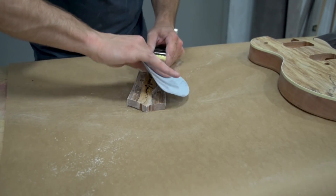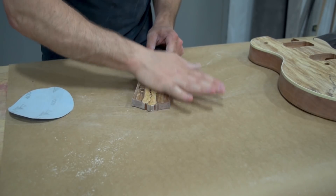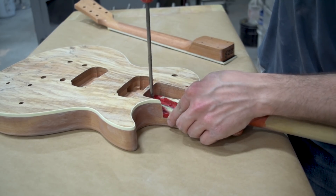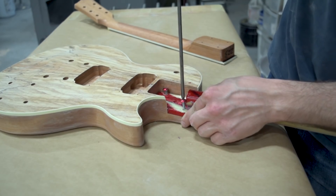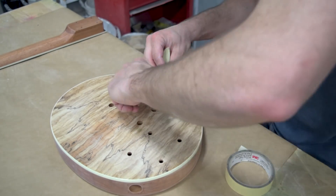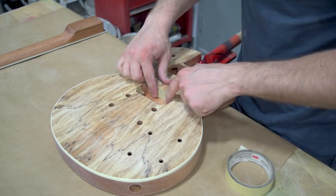For the headstock itself we've got an interesting situation — one I've gotten a lot of questions about — preserving a signature. This signature I'm assuming is done in Sharpie. What I'm doing is sanding as close to it as I can so there's some grit for the paint to stick to, but I'm not actually sanding the signature itself. Now I'm attaching the neck bolt-on jig that I made — screwing it in like you would a neck except from the opposite side, so just the pointy end of the screws comes out. You can check out my video on how to make your own guitar spray stand.